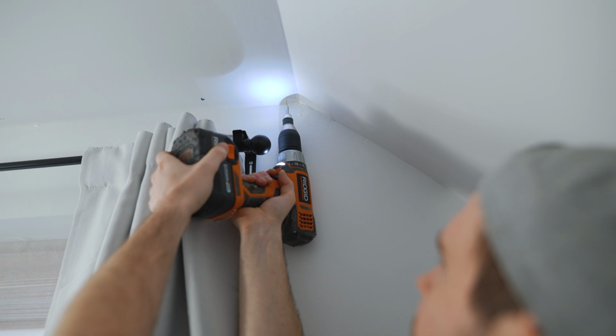Now that we have all of the grommets into the other 2 sound blankets, we're gonna start drilling holes into the ceiling in order to put the hooks in, and then we'll start to hang the sound blankets. So I have my drill here, and it's much smaller than the actual thread size of the hook, and that's important because we just want to make it enough that we can start to screw the hook into it, but we don't want it large enough that the hook falls out. So it's just enough for it to grab. Now I've already figured out the measurements for the sound blankets and this room for where I want to place things. Let's go over here and drill this. And then I've already drilled the other 2 holes at around 71 inches, which makes sense for the sound blanket size that I have. Next, we will grab our hooks and you just screw them up into it.